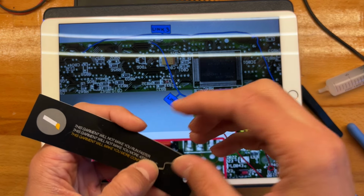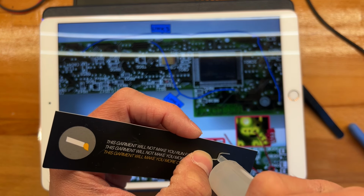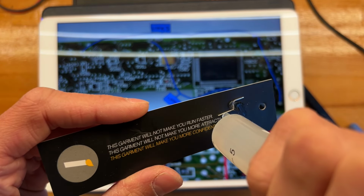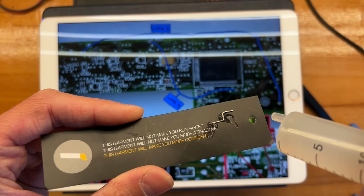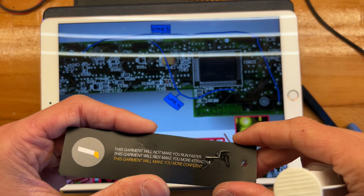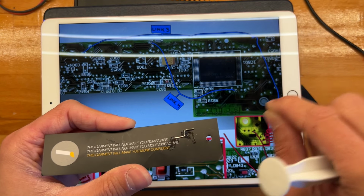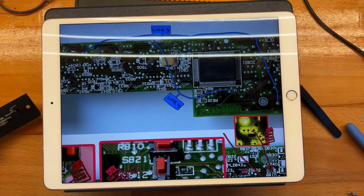And just where you have the wire passing, let me see if I can actually demo this, right? So you have the wire passing and just douse the area, just a bit like this. Boom, and I like to do it well, not this close, but, right? And once this dries, again, you saw how rubbery this sets, and it will not allow the whole wire to have huge vibrations, right? It'll increase the frequency that this resonates at.